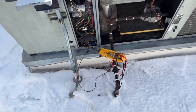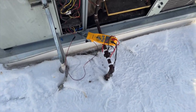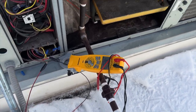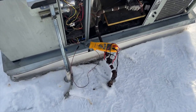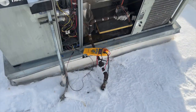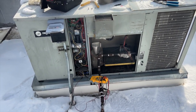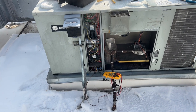We've got it all cleaned up. We're going to cycle heat and make sure my wires don't melt. I have my amp clamp on the wire just to make sure it doesn't go above five amps — you can actually monitor amperage to see if your wire is going to melt. Here we go, plugging it in. Wires don't feel hot, that's a good sign. We have ignition! We're right at five amps — right below six amps, so I'm okay with that; the unit's old. Anyway, hopefully this helps when you come across one of these shorts. Thanks for watching — like and subscribe!